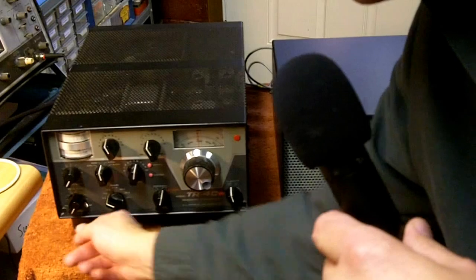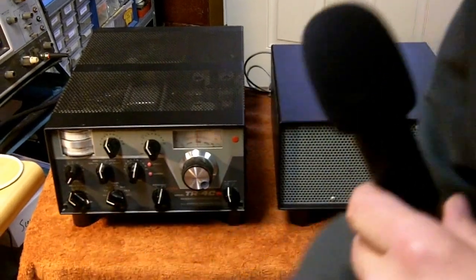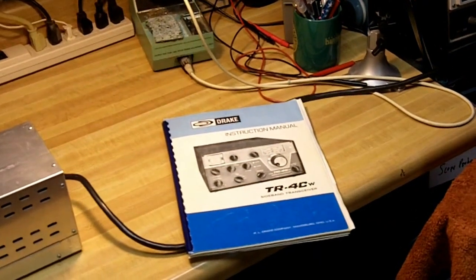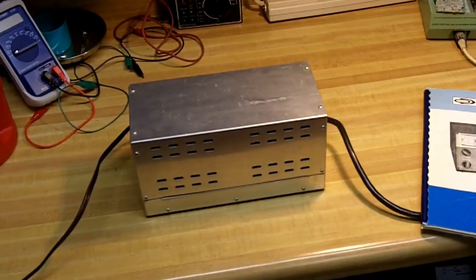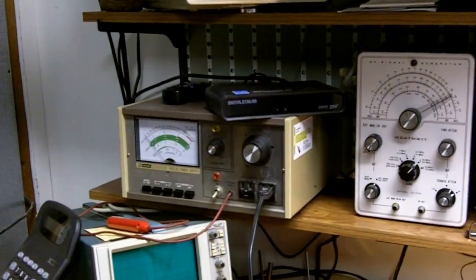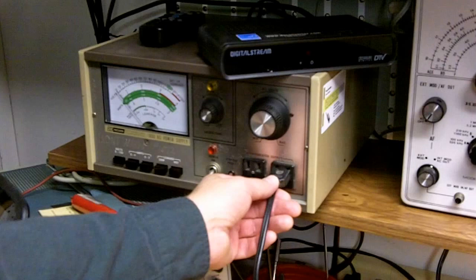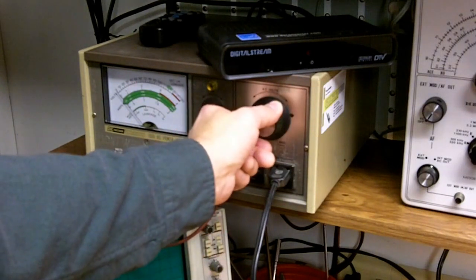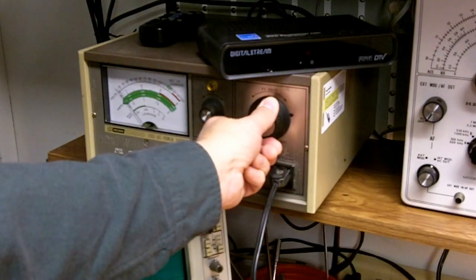I have everything hooked up with no power applied, and I'm going to turn the radio on. There's the original manual, and there's the power supply — I have it removed from the speaker cabinet right now. I have it plugged into a Variac power supply, and we're just going to let the radio sit and bring the voltage up slowly. The power supply is plugged into the Variac and isolated power supply, with voltage set to minimum right now. I'll go ahead and turn the switch to on, monitoring my voltage.